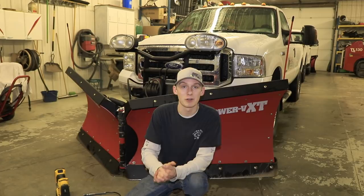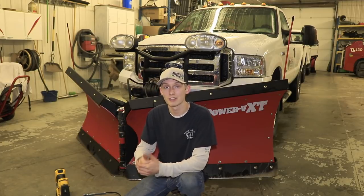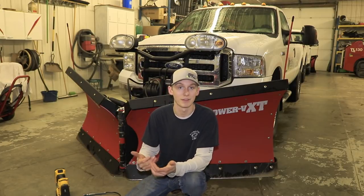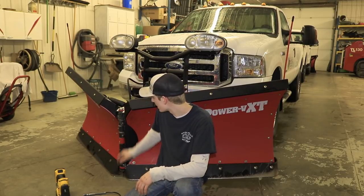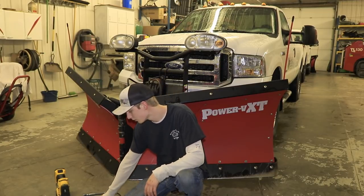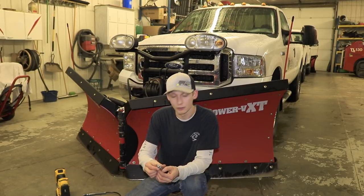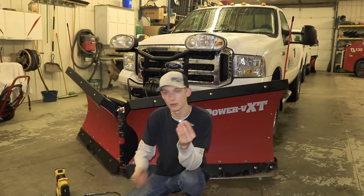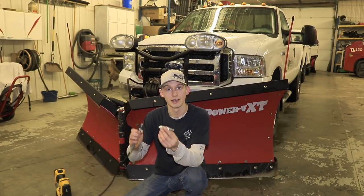The first thing we're going to talk about is just greasing the plows. I've had a lot of people ask me when I was greasing the plows like, "I didn't know you could grease those. Where all can you grease them?" The simple truth is a lot of people just don't know that. Basically we can grease the main column here — they've got little holes in there where you can stick the special tool that we have. It looks like it's made by Legacy and it's called the Lube Link. It's got a little pointy end on it and the other end just hooks up to your normal grease zert to hook up to your grease gun like we have here.